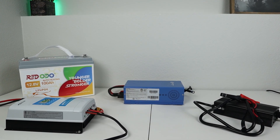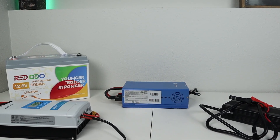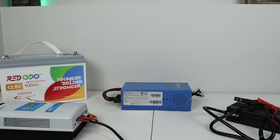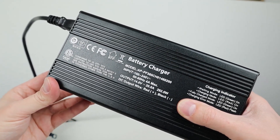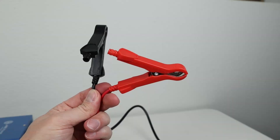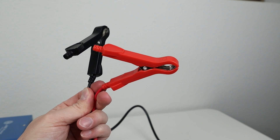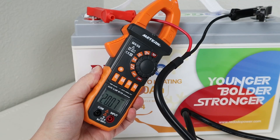I've gone ahead and put the battery back together and it looks as good as new. I want to show you guys three different ways to charge the battery. One of the easiest ways to charge up a battery like this is by using a dedicated LFP charger — this one is a 20 amp model and comes with alligator clamps. All you have to do is plug it into the wall and connect it up to the battery. You can see we're charging at 20 amps, and this will take around five hours to fill up the battery.